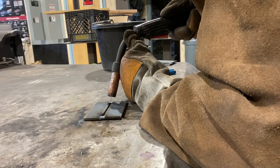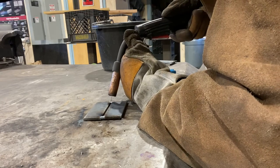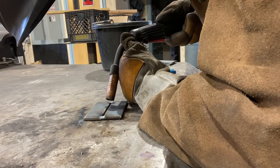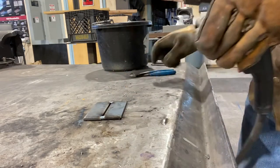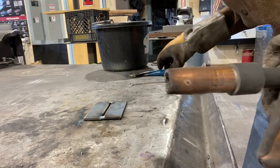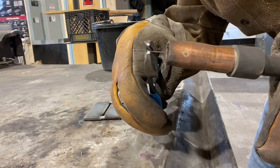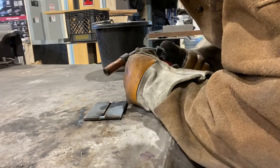My angle is not gonna be a sharp 45-degree angle. I'm gonna have it up closer to 90, maybe just a little bit off from 90. I'm just gonna inch along continuing to do my pattern, maybe something similar to what I did in my pull method. And then with the pieces of molten weld left over, trim it off. Start off with a clean piece of metal.